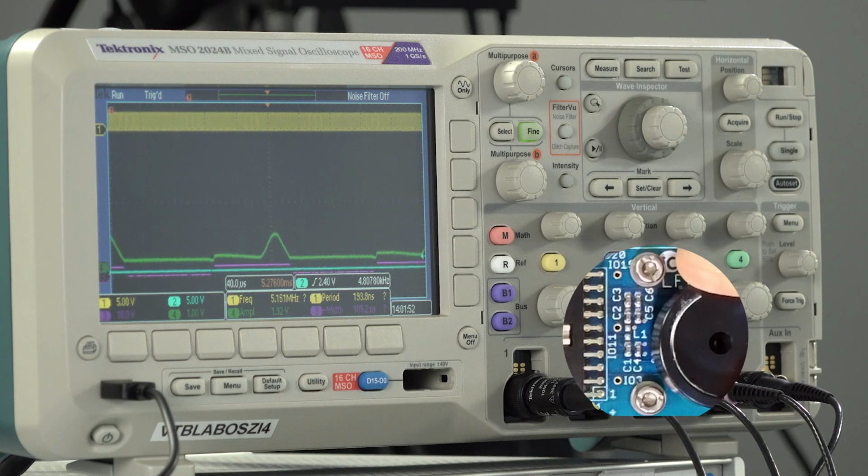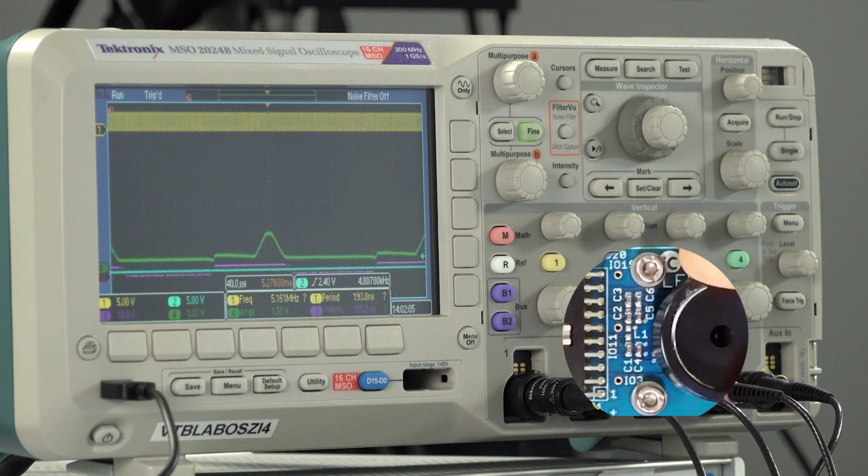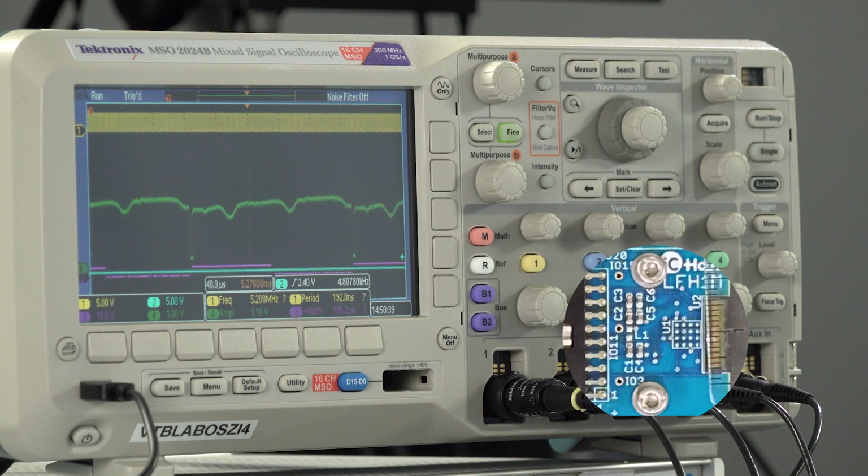Yes, this is beautiful. Anyways, now there's only one positive peak on the green signal trace. Obviously, the peak moves corresponding to the position of the pinhole. This is a more realistic depiction of a triangulation signal. And to show off a more complex pattern, I have a transparent ruler with me. And if I place this ruler over the sensor, we see various dips in the ambient light. Those dips are the shadows cast by the distance markers.